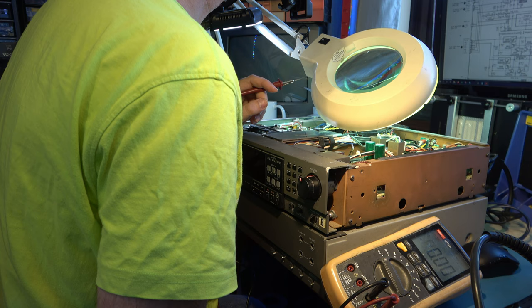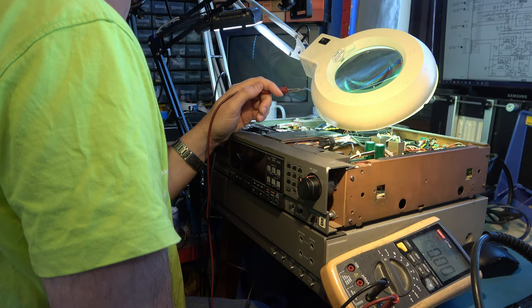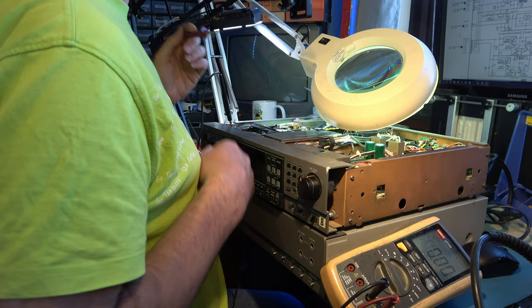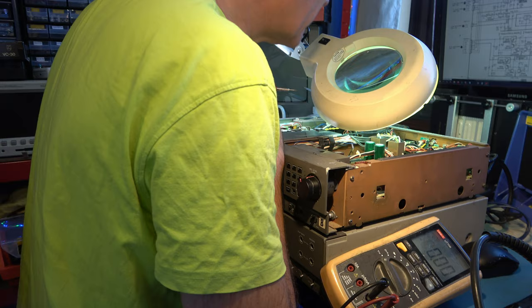Should I stick an oscilloscope on? I don't know. Trouble is with startup sequences, it's very hard to see what happens the moment you switch the power on. I suppose I could find a way, but let me just investigate the circuit a little bit further. There's an IC903, which is 74HC04P. Set of inverters. That's on the power supply board somewhere.